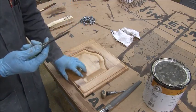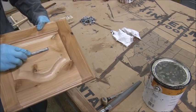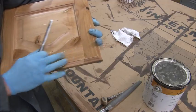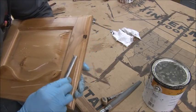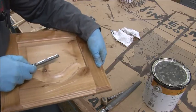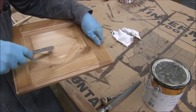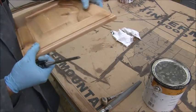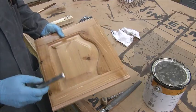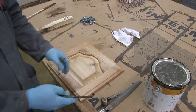This next technique is called hewing. You take the chisel — if something got scraped along there, you just scrape right in and that takes pieces out. I'll make a nice long jagged mark right there, and I can scrape some of this edge off. I don't want to dig in and pry up — these marks are very light, not very deep. I don't want to take a hammer and rip it out; that's a bit too much. You can go lighter — just a few scrapes. Very light distressing. I'm doing a heavy distress; there's medium distress, and whatever you feel is right.